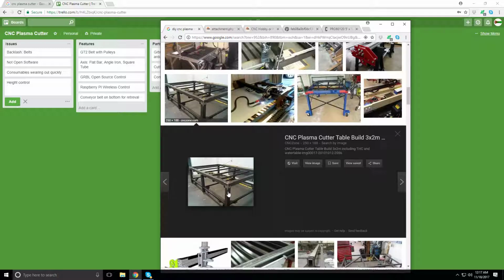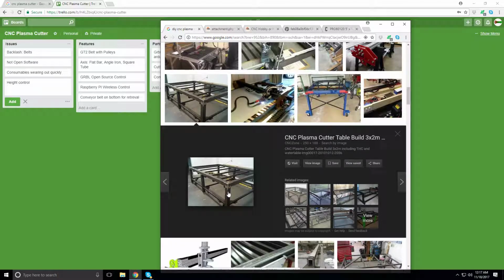Obviously bolts and nuts is going to be like 3 times the amount of work needed, because then you need to weld plates with holes in it, perfect holes in the back of these pieces here, and then you need to weld nuts inside of the tube so that they stay where they're supposed to be. So definitely not, because you probably don't want to thread even 1/4 inch wall or 1/8 inch wall of the square tube. So I'm thinking right now just weld it and then have to measure any sort of door where I build it so I could get it out of the place and get it into the new place.